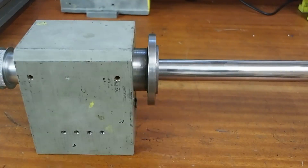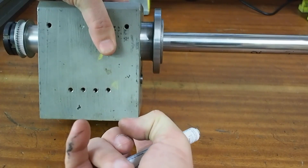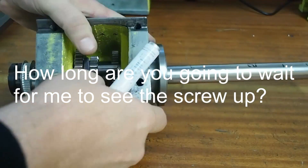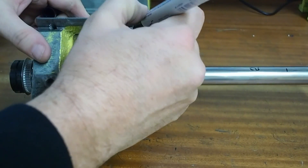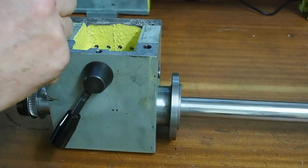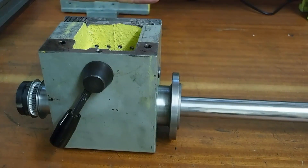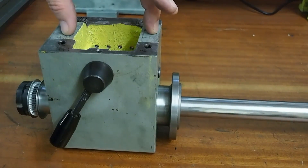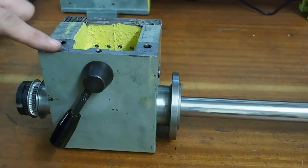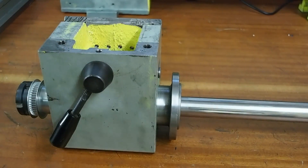To correct that error, I need to rotate the headstock in this direction. That means I need to take metal off the back side here — off this part and correspondingly off this part. Once I've taken metal off those opposing surfaces, which will rotate the headstock on the bed, it will also widen the Vs, which means the headstock will drop down some, and I'm going to end up having to remove metal off the back way to even things back up. But first, let's do those two.